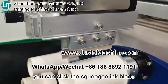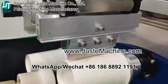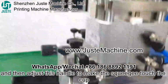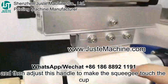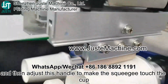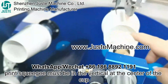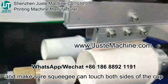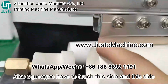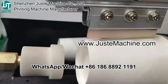You can click the squeegee ink blade, put the squeegee down, and then adjust this handle to make the squeegee touch the cup. Squeegee must be vertical at the center of the cup, and make sure squeegee can touch both sides of the cup. Also, the squeegee has to touch this side and this side.